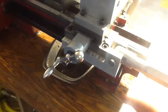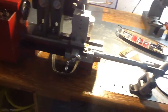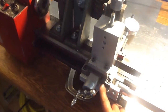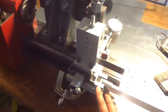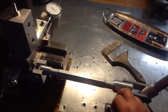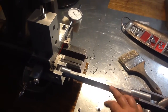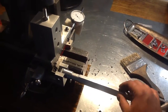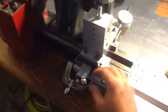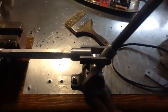All these parts were machined on the lathe. I don't have a mill — I would love to have a mill, but they're expensive, and I've read a lot about how you can do milling on the lathe, so I've been getting into it. So we've got the block here connected where the apron would be. Got a pivot point there. All these bits I just machined — this is just junkyard trash. I machined flat spots there to connect this. That's actually a gate tensioner for changing the distance — you can turn it to get a little more length or whatever, get it dialed in. And then just a series of holes bolted in my table.